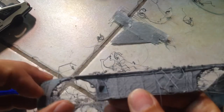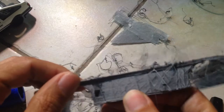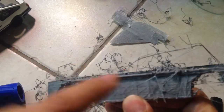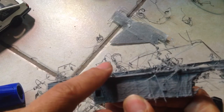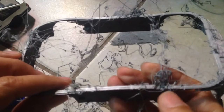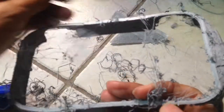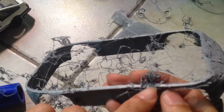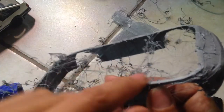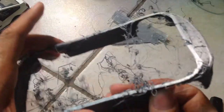Since I was sleeping and left this running overnight, it kept moving around. As it was building these last layers, eventually this part got a little bit too high and the nozzle — the hot end — smacked against it hard enough and just ripped it off. You can see there's a lot of melting right here. Most likely this part making this turn here is the culprit — it lifted up higher and dragged the whole thing off the build plate.